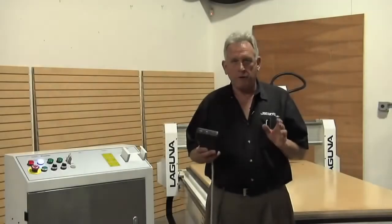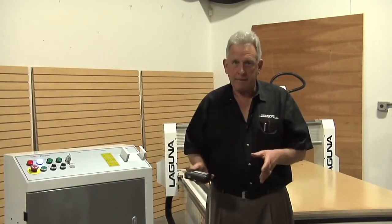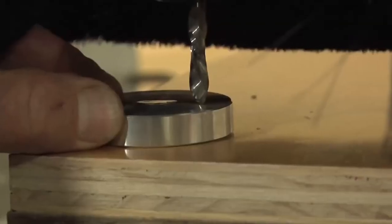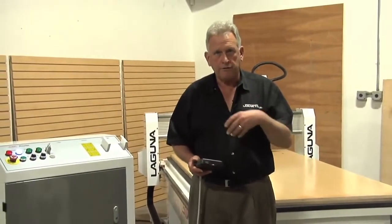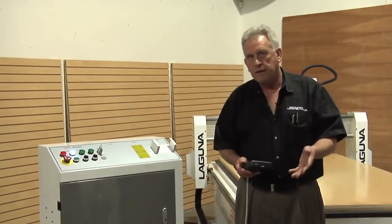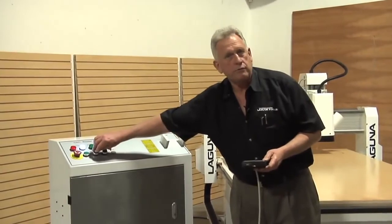We're just about ready to run our golf bag rack on the Smart Shop one. Here's what we've done so far: we've basically put the gasket in the vacuum table, applied the spoil board to test it, and everything works. We've made sure all our valves are open, put our material on the table, and touched our tool off. The first tool that's going to be used is the 5mm drill, so the first thing you'll see is the holes get drilled. Then we're going to change tools, put the compression bit in, and use automatic tool touch-off for that. I still have to hook up the dust collector hose, and we'll turn the vacuum pump on with the switch right on the machine control.